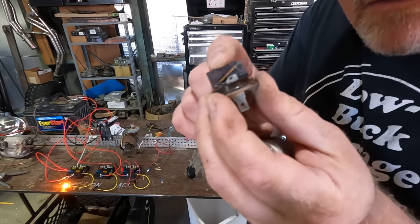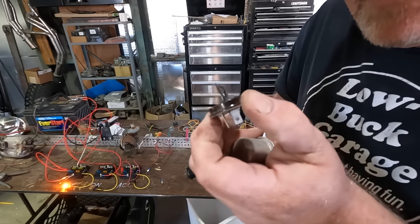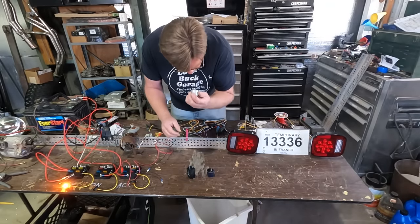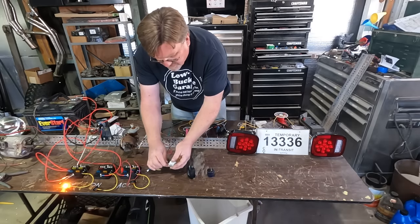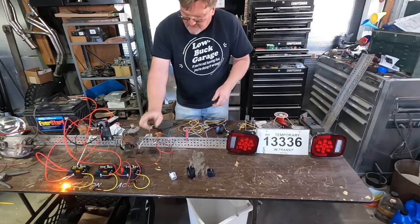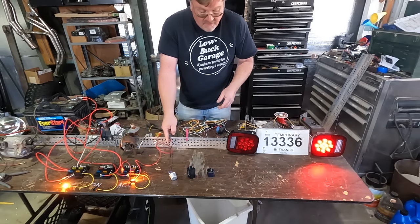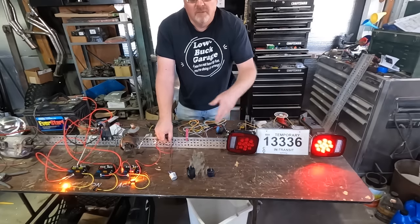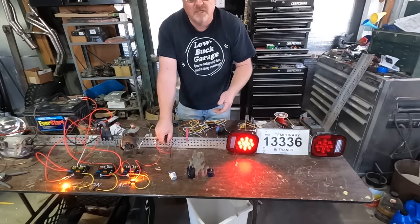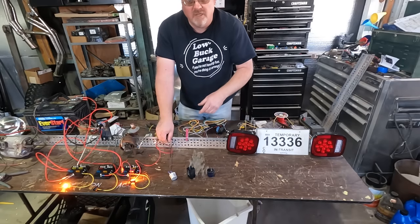Because it's heating up an element, you need a certain amount of electricity going through it to get it hot enough. These do not work with LED bulbs — LED bulbs draw so little juice they don't heat up that little element. So you have an X where your power comes from and an L which is your load or lights. I hook it up and turn it on — with LED lights it just sits there. The electricity is going through that little wire trying to heat it up, but there's not enough. So these don't blink with LEDs, and I knew that was going to be a problem from the start.